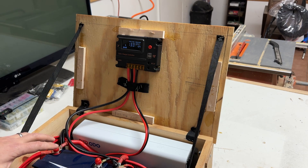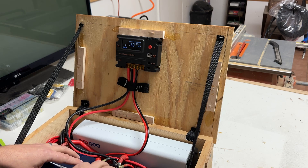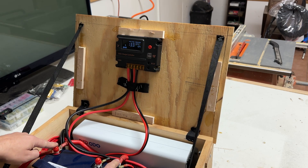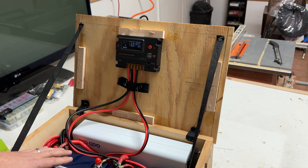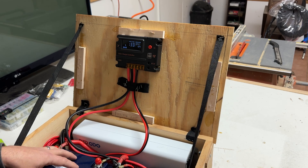The other thing was that you can't wire lithium iron phosphate batteries in parallel — and that is just a hundred percent false. Right in the manual, it shows these wired in parallel or series. The battery management system will automatically regulate this, so it's not going to hurt anything. This is negative to negative and positive to positive. These are going to automatically balance each other. If I'm pulling a little more off of one battery, as soon as the draw stops, that battery will actually charge the other one. They automatically balance each other when wired in parallel.